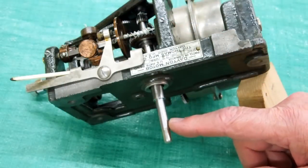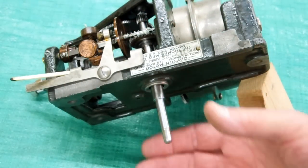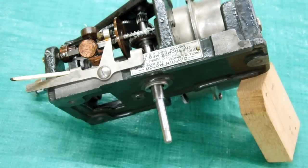The drive shaft or spindle shaft was tapered in this area, and the turntable for the record player sat on that taper. I've machined that to five-sixteenths diameter and the drive gear for the gear head will attach to that.